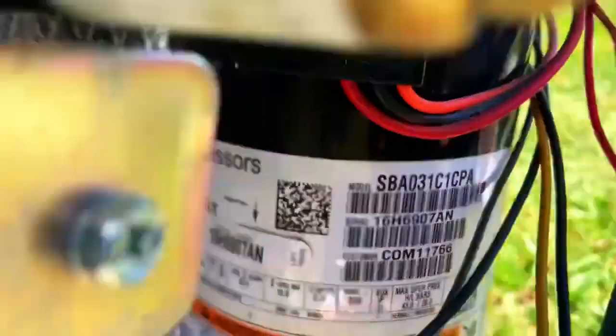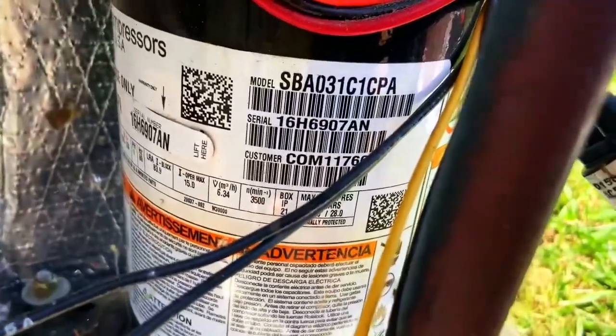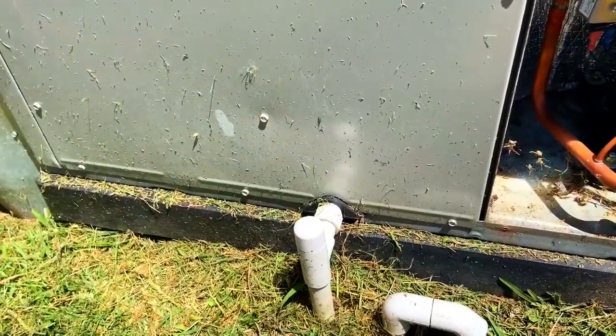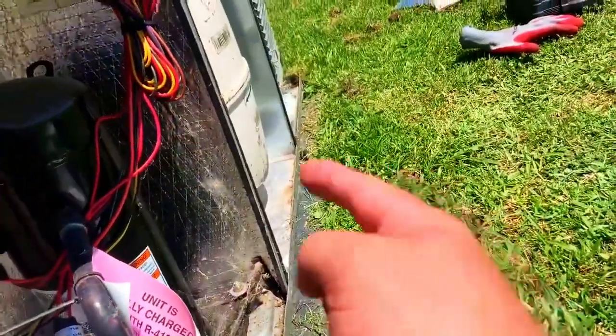There's another tap for liquid right there, passing between the condenser and evaporator. Alliance compressor — 2016 model. Looks like it just needs to be cleaned up a little bit. I'll take this last panel out and take a look at the evaporator since we're sitting cockeyed. We'll see how it's draining — looks like it is because there's no water in the cabinet right there.